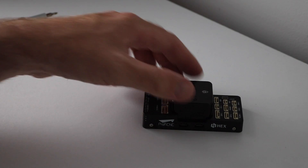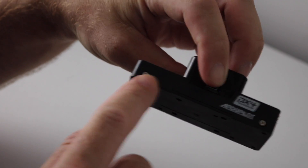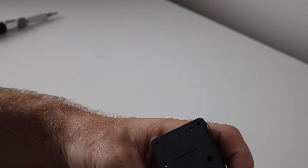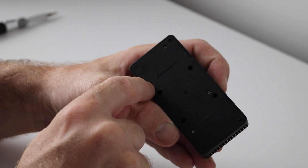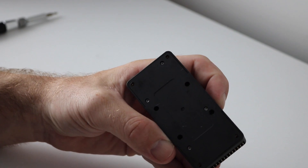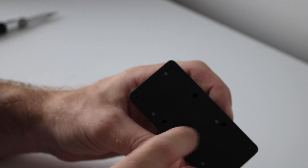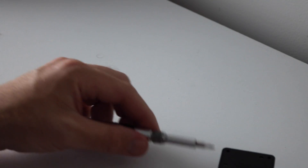So what we're going to do is look at fitting the Edison first. We need to remove some screws — eight screws in total. On the side of your cube you have two on each side, and then on the base you have four. These four on the base are what hold the cube to the carrier board. If we just remove the four on the sides the bottom will come off, but the carrier board will remain attached to the base plate, so we actually need to remove all eight screws.